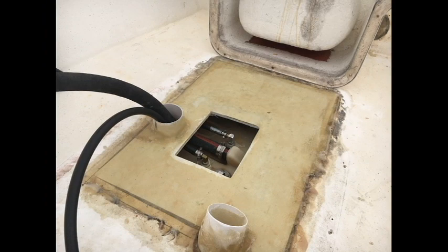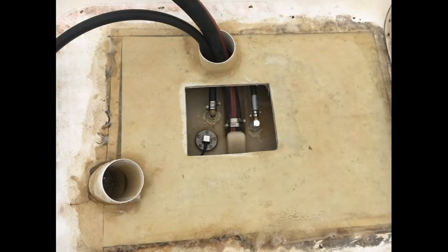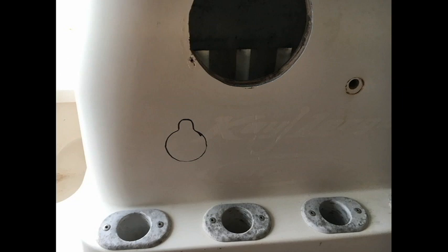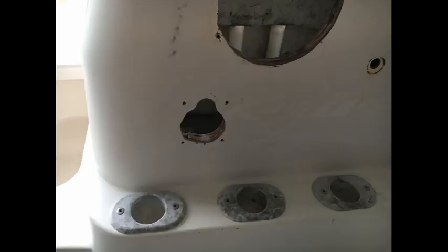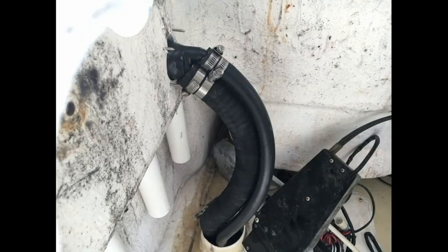I thought: what would happen if I put the fuel filler on the side of the center console, so there would be no restriction with the gas filling the fuel tank? That's why you see that extra tube there. I coated everything with fiberglass and resin — it didn't need to be pretty. Here I am tracing the new fuel filler door opening, and there I've cut it. There's the new door — it looks pretty good. This is what the inside underneath the console looks like now with the new fuel filler and breather tube.